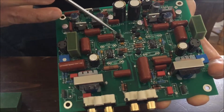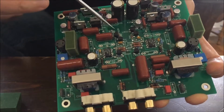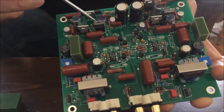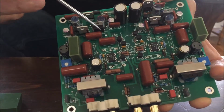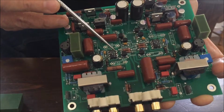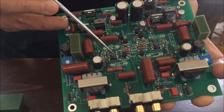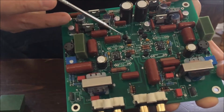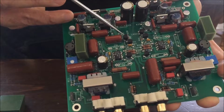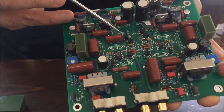Here, there are these components here. There's other ones around them on the board, but these are all shunt regulators, and there's current sources. The shunt regulators are used to pull current from the regulator right to the pin of the op amp, so that you have a constant supply of current running right past the pin of the op amp. When the op amp needs to amplify, it has the current right there. And lastly but not least, we use the same component as a current source to bias the op amp into Class A. So that means you get a very clean amplification.